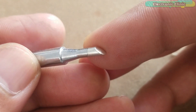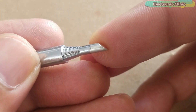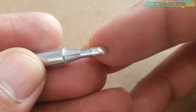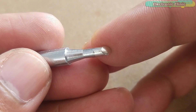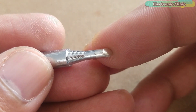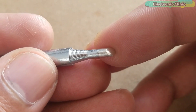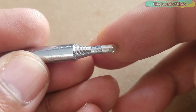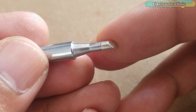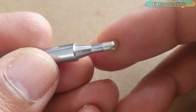Due to its large, slightly curved surface, the bevel tip can hold more solder than most other tips. It can be very helpful in soldering small gauge wires together or drag soldering. The bevel type or C series tips can be really helpful in applying small amounts of solder over multiple components in close proximity, such as the pins of a surface mount component.